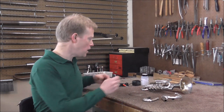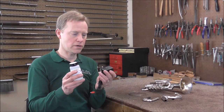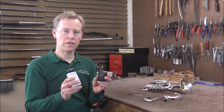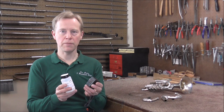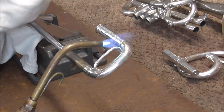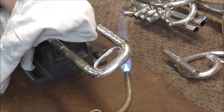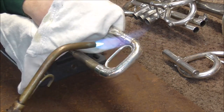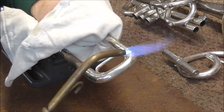After I'm done patching the cracks, I'm going to use my new spot plater to silver plate over the cracks where I silver soldered. I have never used it yet — I got it just a few days ago — so I'm going to try it on the video next week. If the silver plating goes well, you probably will not even be able to see the cracks unless you look very closely. Because I'm going to silver solder, I need to get all the soft solder joints off that are anywhere near where I'm going to silver solder, and then I'll just put them back together when I'm done.